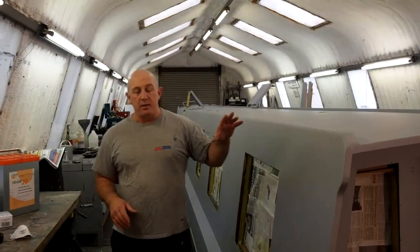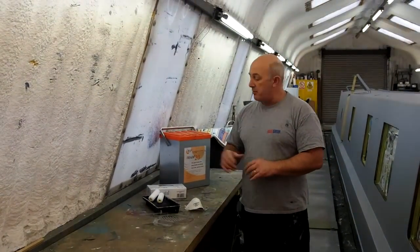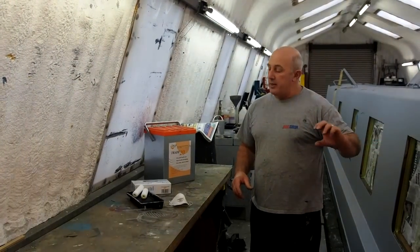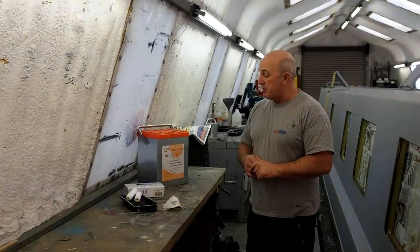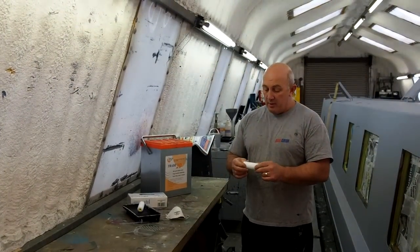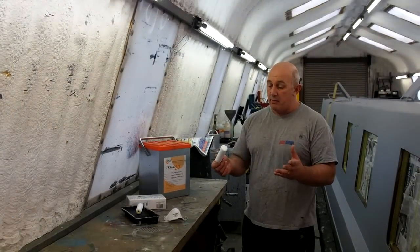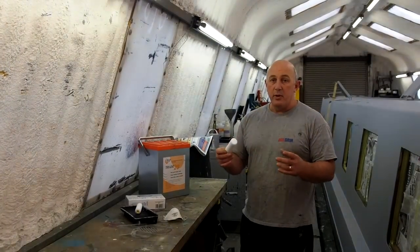Before we go on to that, you've seen us using rollers — sometimes that comes as a bit of a surprise to people. The idea of using rollers is we get a nice even coverage, it's easy to apply, and we can easily meet the manufacturer's specs as far as applications are concerned. The rollers we prefer to use are a fairly high density foam. You can use all sorts of rollers for this type of application — some people like to use larger mohair rollers. I like a four inch roller.